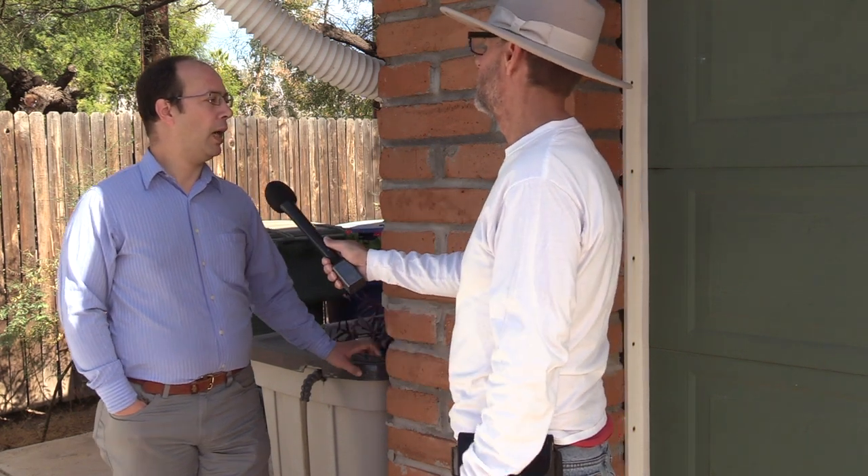Looking at your job — the coloring, how the Silox was applied — are you proud of what you did? I am proud. If you go in the street you can clearly see this wall looks different because I applied the Silox — water bounces right back if you spray it. And for the bricks that I repaired myself, it's very hard to see any difference from the street. They blend nicely with the surrounding bricks, so I'm very satisfied with how these bricks came out.